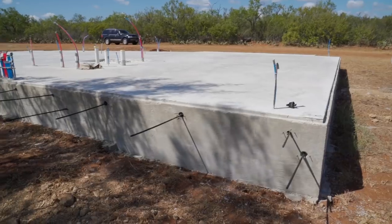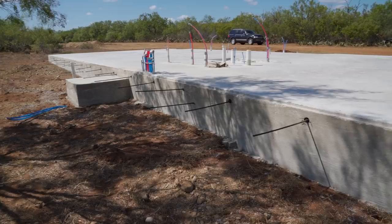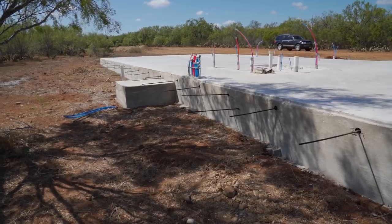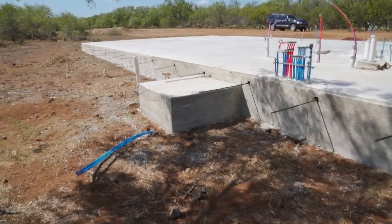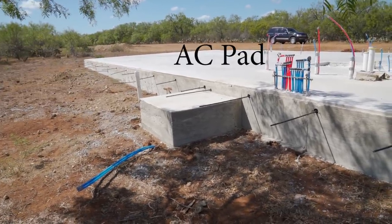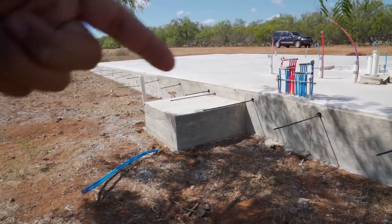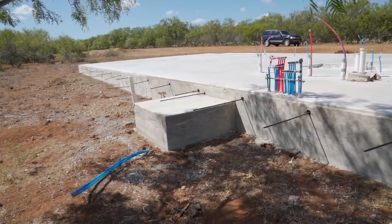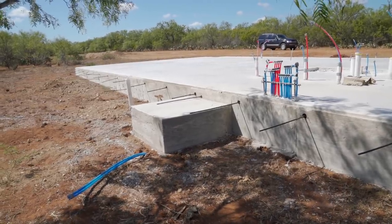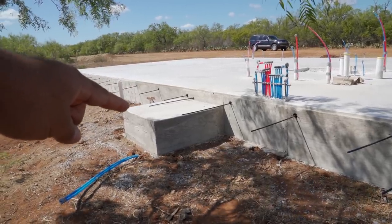As you can see, there are a lot of cables on this slab. All these cables are going to put this foundation under tension and hopefully keep it from cracking. You might be wondering what this 4x4 landing is right here — that's actually for the HVAC unit, that's where we're going to put it. We always put our slabs attached to the house and well into the ground so we don't want it to transfer any vibration, float away, or anything to happen to it. We want it in place for the life of the home. That's our AC pad.